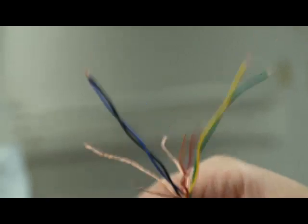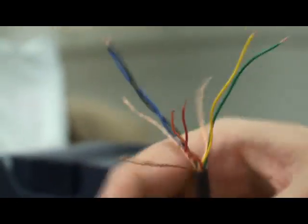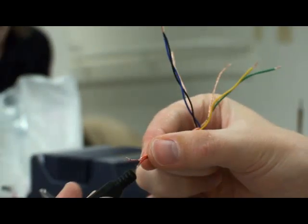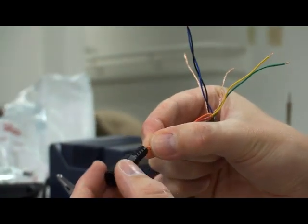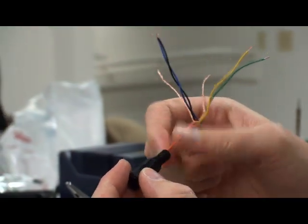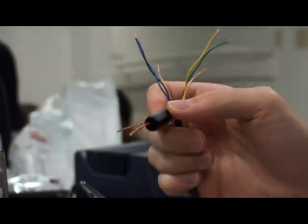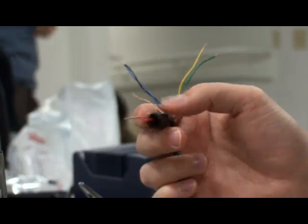We're going to work now on the other end. The important part about the other end, something we've done a million times over, is you want to put the cap on before you start soldering anything, because otherwise you'll have to desolder everything again to get to the part that you need. The other thing is we also want to apply the insulator in this stuff.